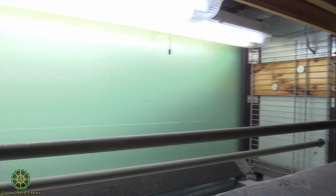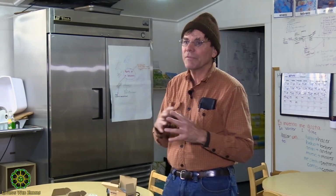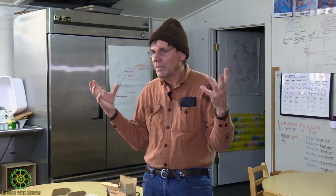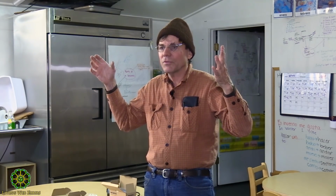So the lighting. It's a chamber, of course, and we have a lot of humidity in there. So we're running humidity levels of 95%. So we have to go find what they call not waterproof, but weatherproof fixtures, or high humidity. There's specific fixtures that are made for that. And normally in industrial applications, which is where most of them are made to go, they can be pretty expensive. The cheapest one I found was $160 per fixture, and they were up to over $400 for guaranteed, in hospital situations, in industrial situations, whatever.